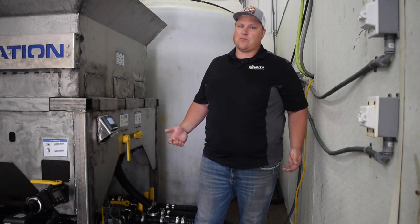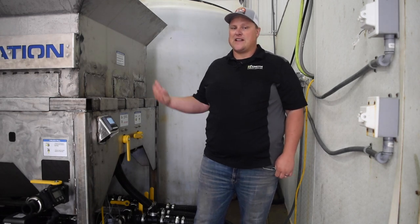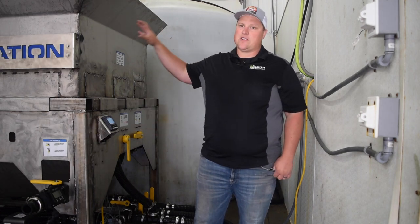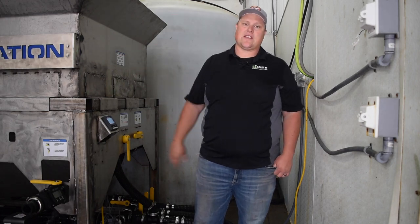And a little bit of a pro tip, when you get comfortable making brine, you can actually get a couple hundred extra gallons of capacity out of your batch simply by loading salt while the system's pumping out. What that's going to do is it's going to displace water in this mix tank, overflow into the back tank, which is your batch tank, and that's going to go out to your tanks.